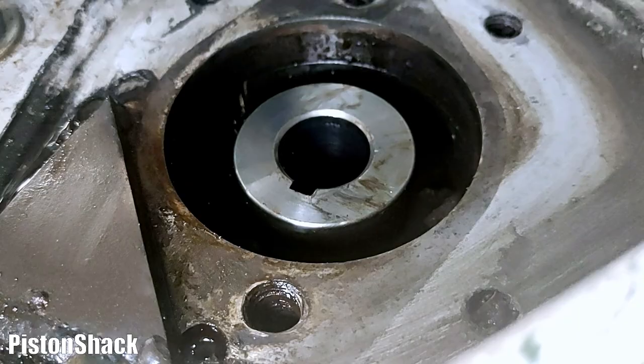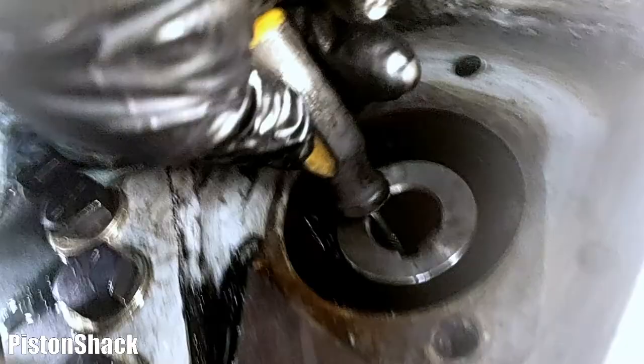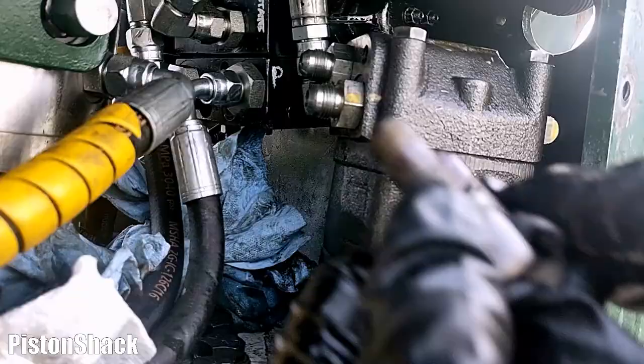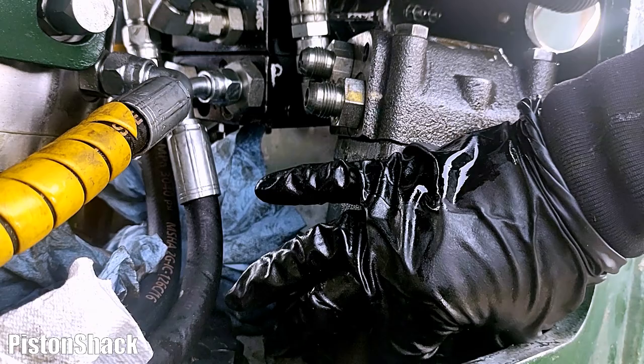Let's remove the other part of the key which is inside the pinion gear — it's still there. Let's pry it out so it will fall all the way down and out. Now our slot is clean and our motor can go back. Let's align that key with the slot — that small pinion gear turns the big ring gear, and that's how everything works on this clamp. As you can see, it's in place and everything's aligned.